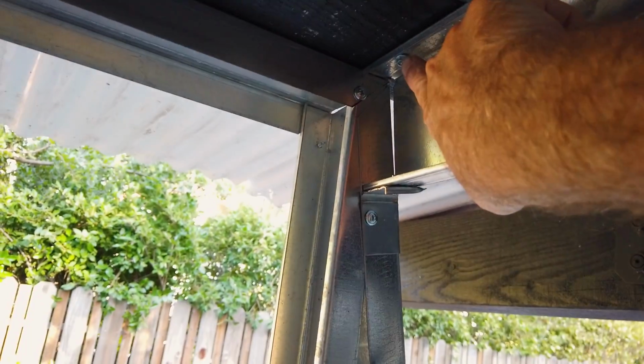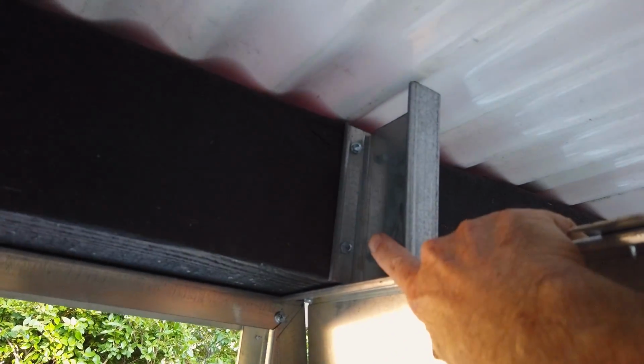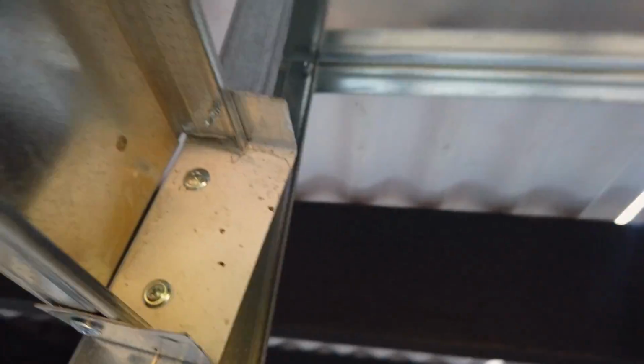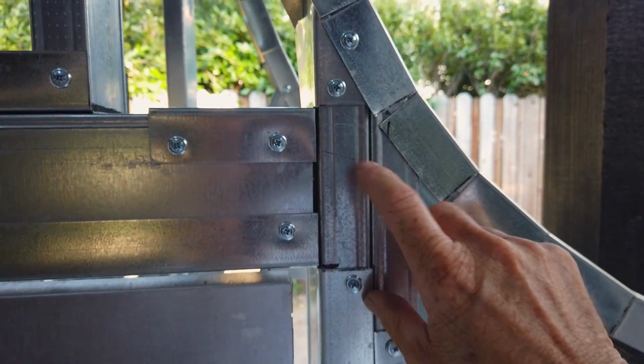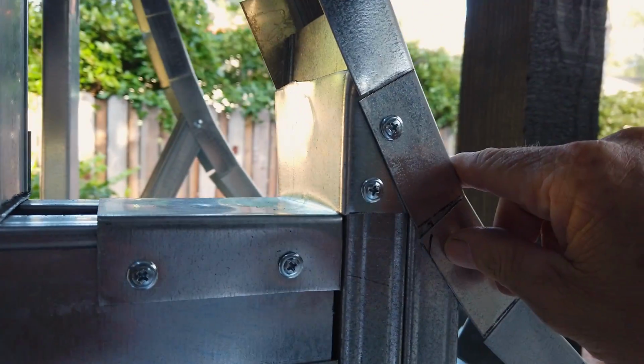The structure is attached to the pergola crossbeam in a few places. I used a 2-inch piece of track to connect a horizontal stud to a vertical stud, near the top of the curved structure. This area was challenging to get it to all fit, but it came together nicely with a few special cuts and pieces.